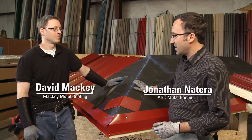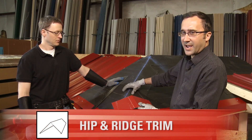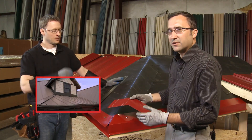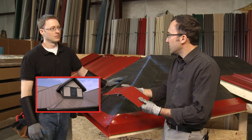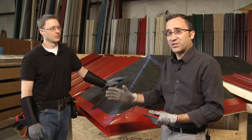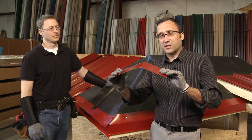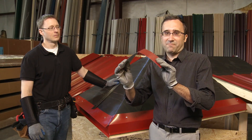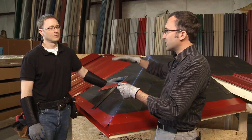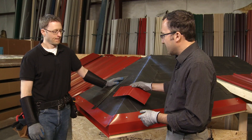We're going to tackle the hip now. This is a hip and ridge trim. A hip cap is used — it's a lot like a ridge at a slope. One thing to keep in mind: a lot of times it's the exact same part you'll use on a ridge as on a hip. The difference to keep in mind is pitch. This is a 6/12 pitch roof, but a hip cap for a 6/12 is going to be not as tight as a ridge cap for a 6/12. So you wouldn't want to use your hip trim on the ridge cap, or else when you start putting those screws in it's going to pull and fight and create waves all the way down.